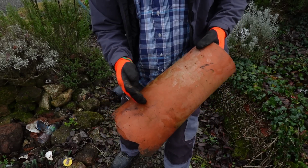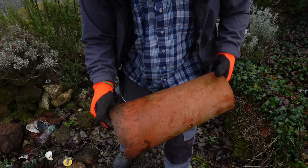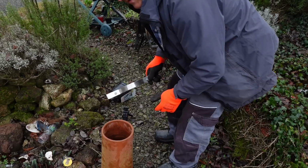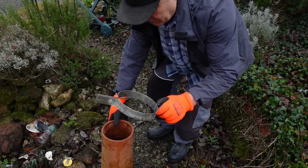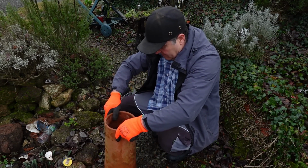I mean, a lot of that is going to be underneath the mortar. It's going to be haunched up quite high. Might be okay. So anyway, this is what we was talking about. The flexi flue liner comes up through the bottom of this. This spans the stones either side, and then that goes on top.